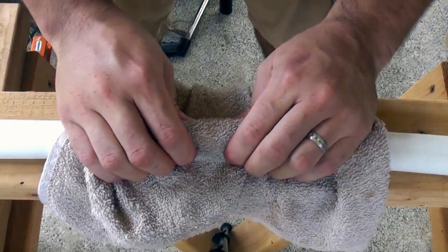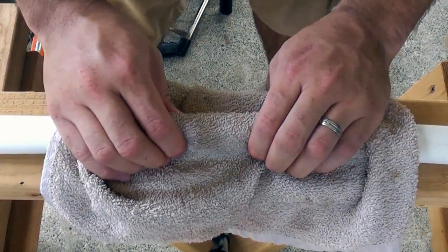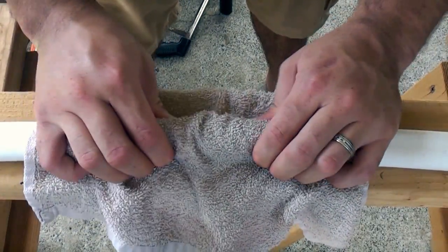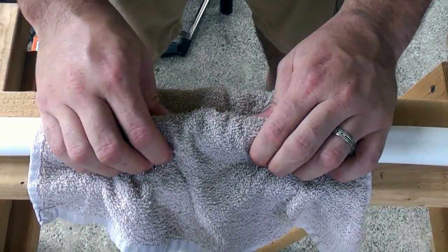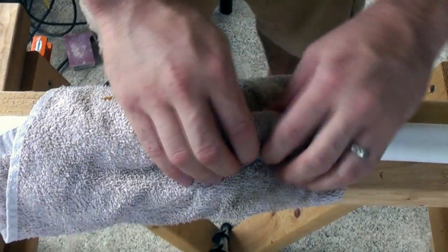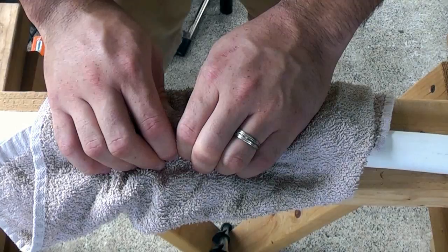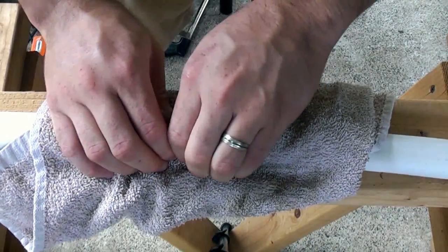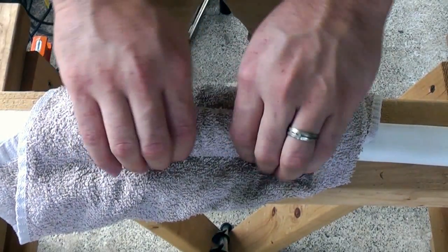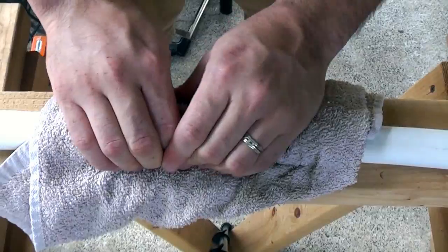What I'm doing is pressing it in near the top and bottom of the handle, but actually leaving the center a little more round. That's going to give you a nice area for the arrow to pass on whichever side becomes the top limb, but you also get a nice thicker center so that the bow is more stable from side to side. Another thing this does is it gives the hand a nice place to rest on this handle.